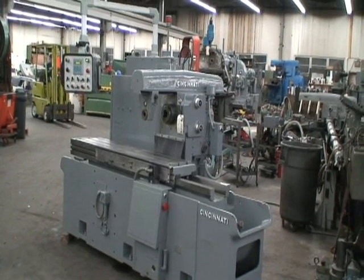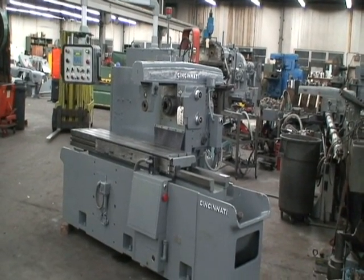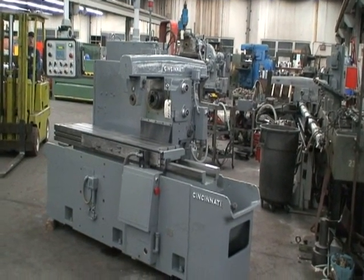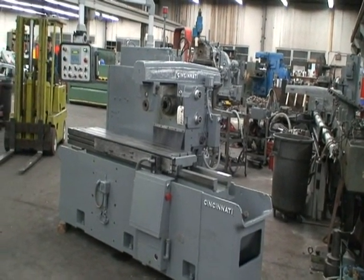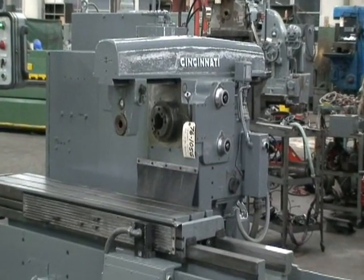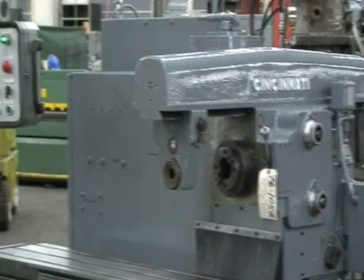This morning we're demonstrating a Cincinnati 200 series High-Powermatic mill machine. We've retrofitted it with a programmable controller and also added a linear encoder on the spindle carrier that allows you to manually enter the cutting heights without having to set trip dogs.